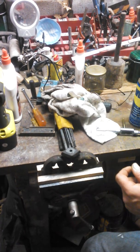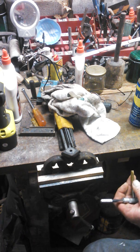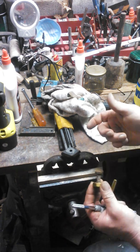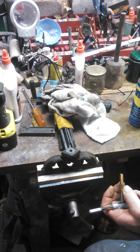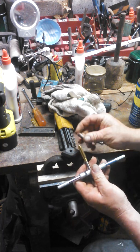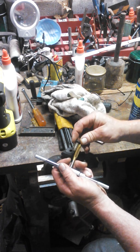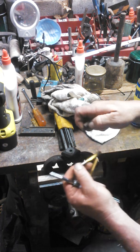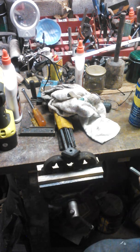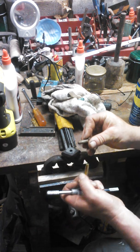I can't get it out. Anyway, I found it for the bolt that I wanted, and I looked in here, and I found where the bolt would screw into. I got the right threads. Found where the bolt would screw into a threader there, and then I got the matching male threader, so that I know that these will be matching and the same. I took and laid it on there. You see how it will fall right into the threads and it won't move. If it's the wrong one, it'll just skate across the top of the threads. It won't fall into it if it's the right one. Now that doesn't mean it's the right diameter. That means it's the right thread measurement. How many threads per inch?